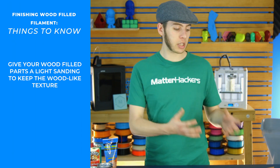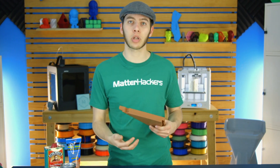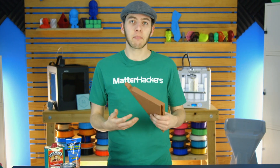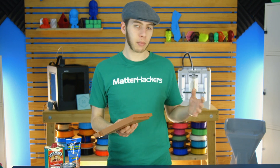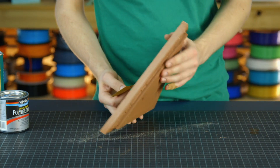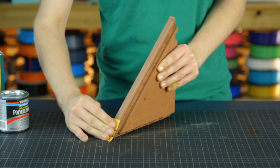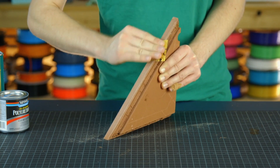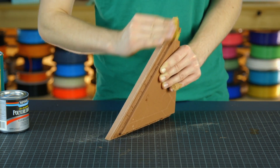Once you've started working on your parts, you're going to want to use a higher grit sandpaper than you might normally start with when sanding PLA, because in this case having the layer lines of the print actually helps sell the look of it being actual wood. If you were to sand this to a mirror finish, it wouldn't really look like wood anymore — it would just look like plastic. So I'm limiting myself to 220 or maybe even 400 grit sandpaper, just lightly going over the edges and maybe a bit more aggressive on top. You can go up to 3000 if you want, but anything too high or too low and you're going to start messing with the intended look of a wood grain.